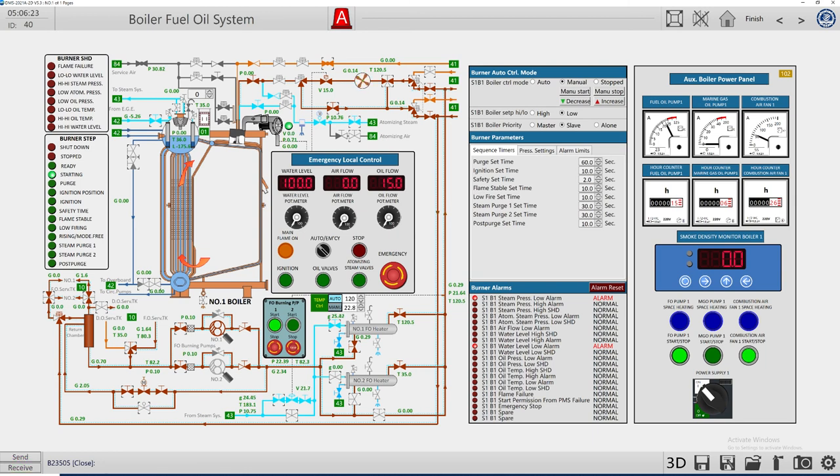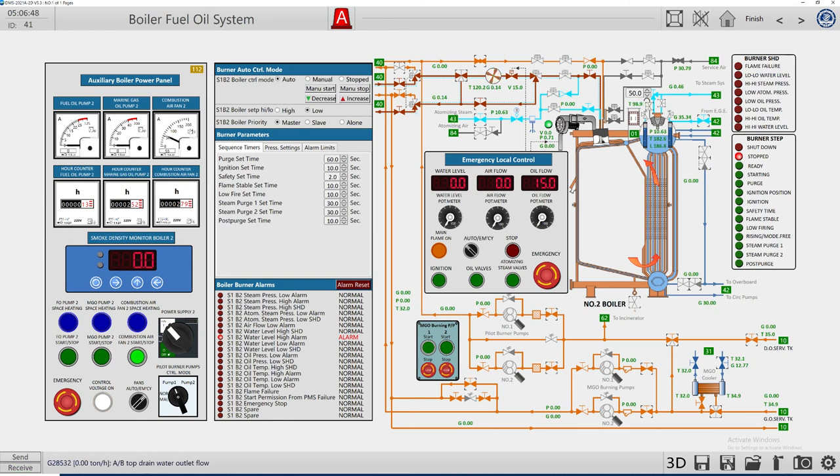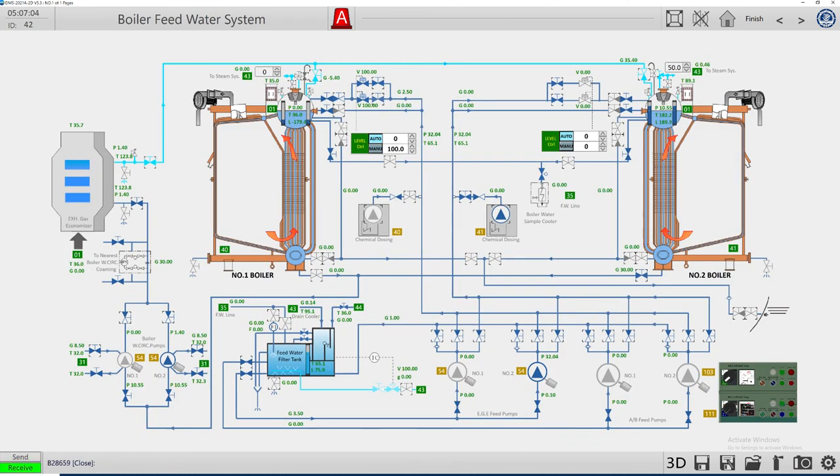I hope my dear friends you have seen a lot today. These alarms will go off and you'll be able to reset them once normal operating values are restored above the preset alarm threshold. The boiler is starting; the other boiler is in auto and stopped. The water level is increasing — the reason is that all the water that was inside the exhaust gas economizer is now easily filling up our steam drum.